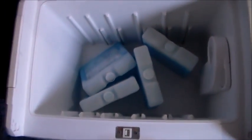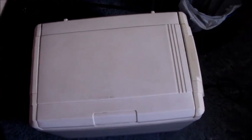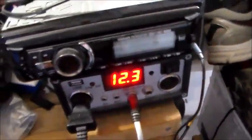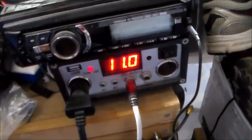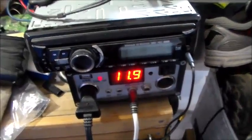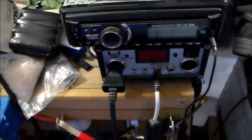If you follow this wire all the way down, right here you see it goes to this little 12-volt cooler here. I do have a few blocks of ice in there just to kind of get it cooler quicker. It's running with no problem whatsoever. This is going to be probably about 100 watts, I'm going to estimate. So it is dipping into my battery a little bit, as you see. Now if I actually turned off the 40-watt panel, here's the voltage change — the 45-watt alone drops it down to 11 volts. So I definitely have to have both solar panels on to keep the voltage at a good level.